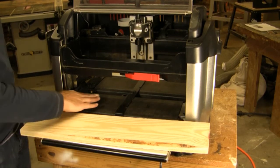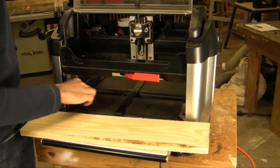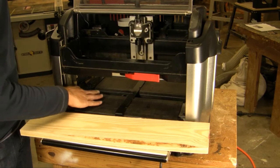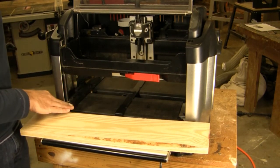The first thing to look at is your belts. This machine has rubber belts, but if you have sandpaper belts, you need to look for sandpaper belt roll-up. That'll cause your board to lift up off the board tracking roller, causing it to give you that error.